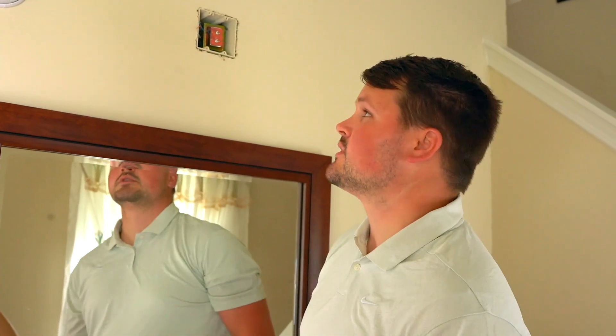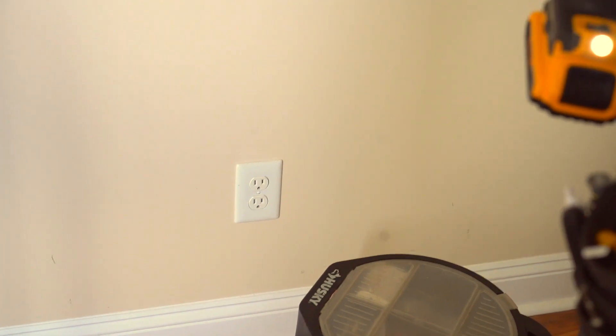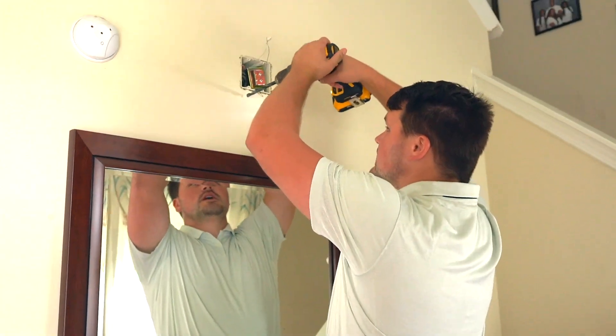What I'm going to do is drill a small hole at the top and then a small hole down by the outlet. I'm going to drop a chain down so we can pull a new wire up through there, so it's behind the wall - nice and neat, you won't see any wire. Make it look professional. So I'm going to start off by drilling this hole up here on top.